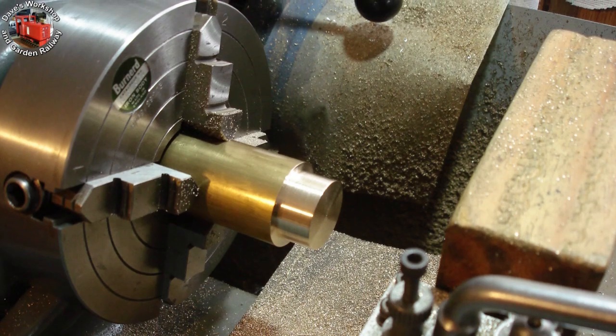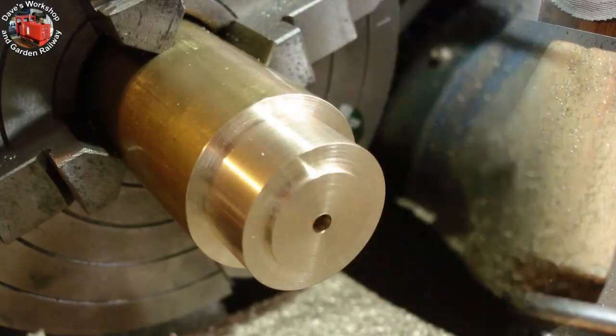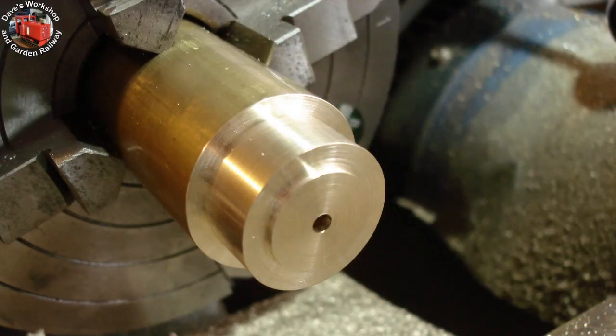The piece is 0.550 inch finished. Very carefully turned bore register — the closer this fits to the cylinder the better. I'm going to use 4mm diameter stainless for piston rods. The hole has been centre drilled, then drilled with a 3.7mm drill, then with a 3.9mm drill. I don't go straight to 3.9mm in case the drill cuts a little oversize.